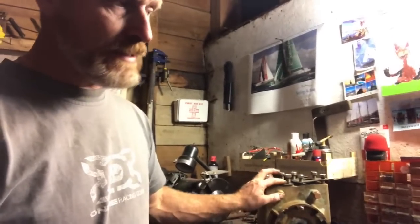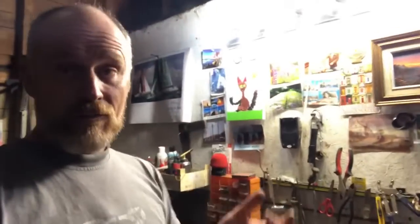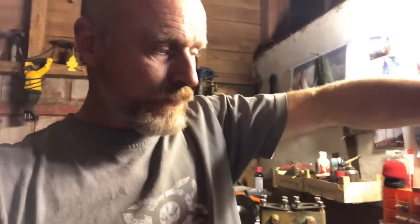And then this one will be getting painted. Here we've got an issue we're dealing with. This is part of the charging mechanism — we've got this carriage that holds the big alternator and allows us to connect the alternator to the front of the Yanmar engine. It had got some damage on the edge of these pulleys, so what we're doing now is just JB welding them back together. It's just the very tip of the valley that the belts run in, so it's acting as a guide — no pressure on it. It looks like someone had a puller on it in the past trying to pull it and snapped it instead.